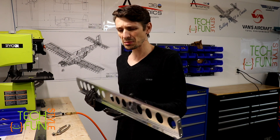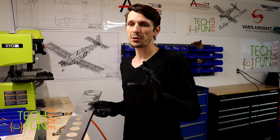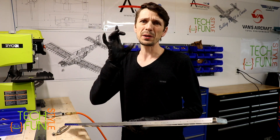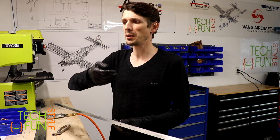It's quite a quick solution, but what I don't like is this deburring wheel table machine - it has regulated speed, but even at the slowest speed it's still a little bit too fast. I'm using the soft 3M wheel, which is 7A rating. I'm still waiting from Aircraft Spruce - I have the 6-inch one, and I'm waiting for the 2-inch one, which I can easily put on the drill or even on the manual air deburring machine. I have that thing with a 90-degree angle. That's probably going to simplify things.